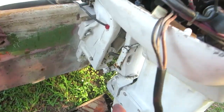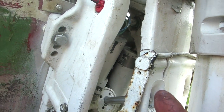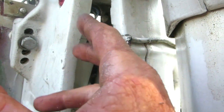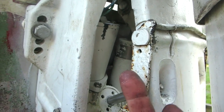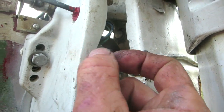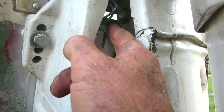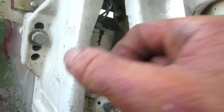I did a lot of stuff I really didn't need to, but I've eliminated all the issues. It'd make a good video completely on reassembling that. I do have another trim and tilt motor — once you take this off your brushes pop out, and you've got to be careful with the springs. You have to put the armature back up into the end plate, get the brushes and springs back in, then there's an O-ring in there before you put the cover on.